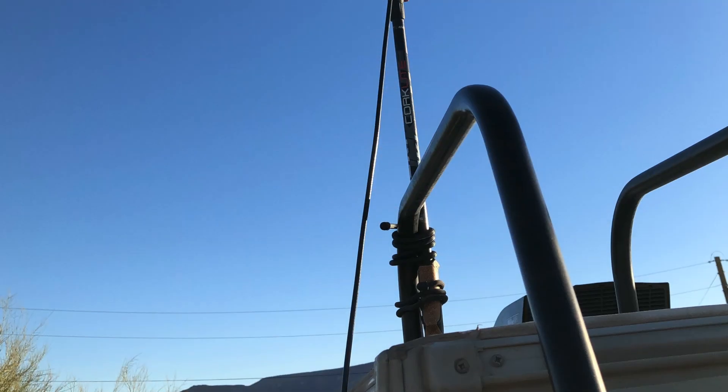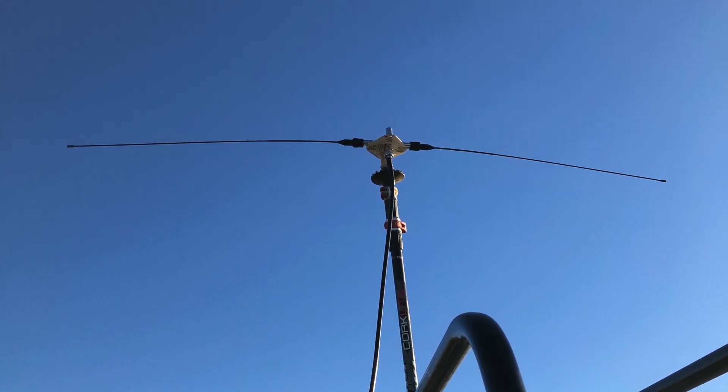You can configure the antenna with two optional BNC antennas: one as a vertical with a horizontal ground plane, or two side by side as a horizontal dipole. My success with six watts on two meter SSB was unbelievable — from that peak over there, Ruin Ridge, I hit Tucson which is 141 miles point to point and was able to check into the net. That got me thinking that SSB is much more capable for local and regional communication compared to FM, even through repeaters.